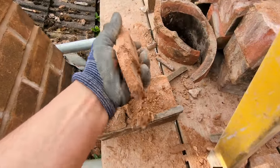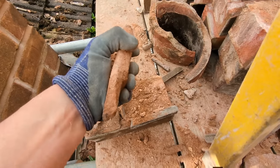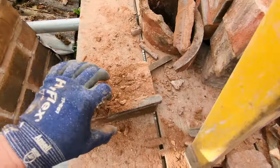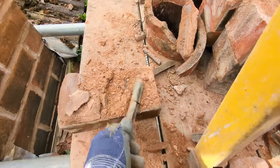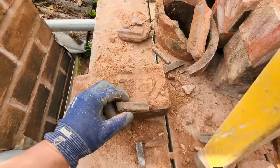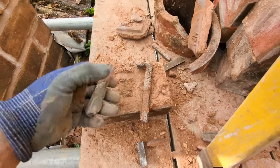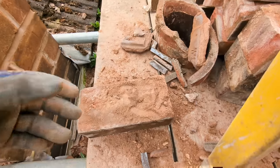You can see the original mortar here — I believe this is actually sand and cement, quite a weak mix. I don't think it's lime because this house was built in the 60s. But you can see it's been repointed with a really hard sand and cement, probably about 15 mil's worth, and it is rock hard. Having this really hard material isn't good for the breathability of the existing mortar on these older properties.